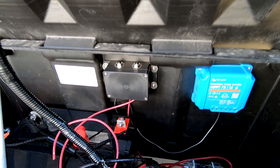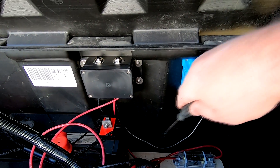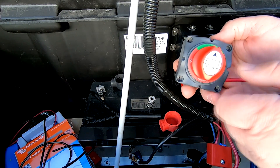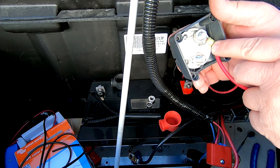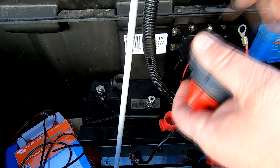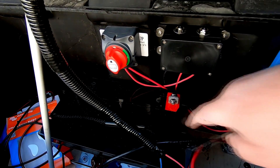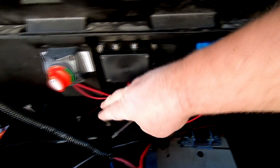Now that I've got the breaker box made up, I went ahead and screwed the charge controller in place. I'm running a negative from the breaker straight to the charge controller, but the positive I'll be running into a switch before the charge controller. So now I'm going to make up this switch — it's basically the same kind of switch you'd use to turn the main power from your battery off. I crimped ring terminals on this 10-gauge wire; one goes into the switch and one goes out. Then I ran the positive wire from the output of the switch over to the input of the charge controller.